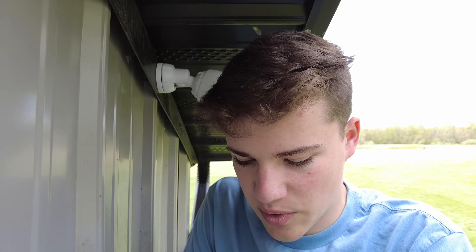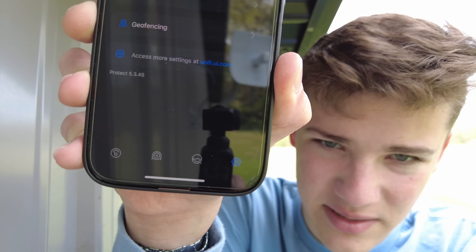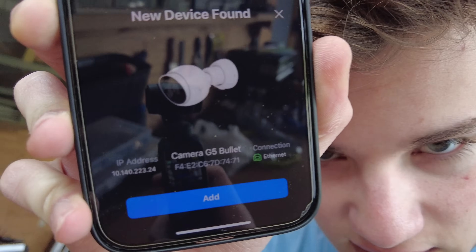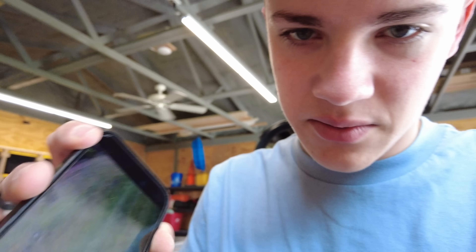Unfortunately, because of the switch I'm using in the barn — it's a MikroTik and I don't have the MikroTik app on my phone — I don't have any PoE status. We're just going to wait for the camera to boot and pop up at the bottom of the screen to adopt it. It turns out the cable was not actually plugged into the camera, not sure what I was doing there, but we've got the camera showing up now. We click add and it's adopting. The camera view is pretty much just some grass, which is exactly what we want — just making sure nobody comes around the barn. I'll go position the camera and we can move on to the turret camera.